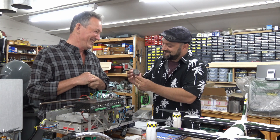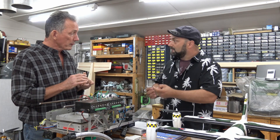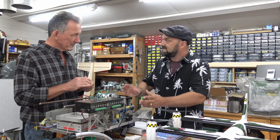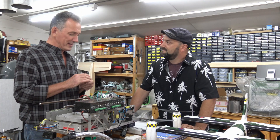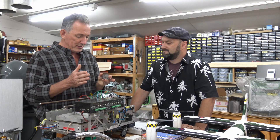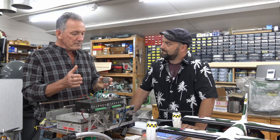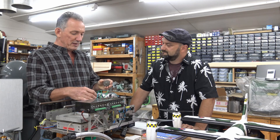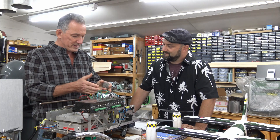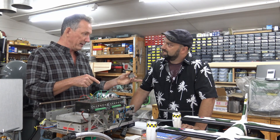So James, what is the biggest learning curve or the hardest thing to overcome when designing and making your own jet engine? It's actually understanding — using a technical term — the thermodynamics of the engine. Basically, as we mentioned earlier, the whole engine works on heat transfer. In simple terms, what we're trying to do is get air to come in cold, heat it up, accelerate it out of the back end. Thrust is the net difference between the speed the air goes in at and the speed it comes out at.